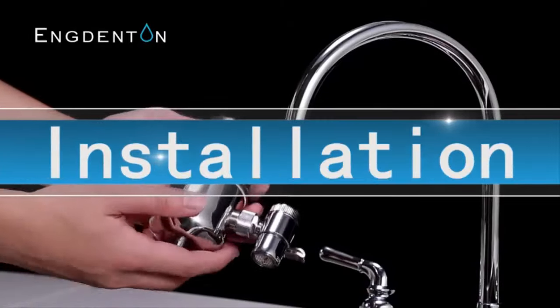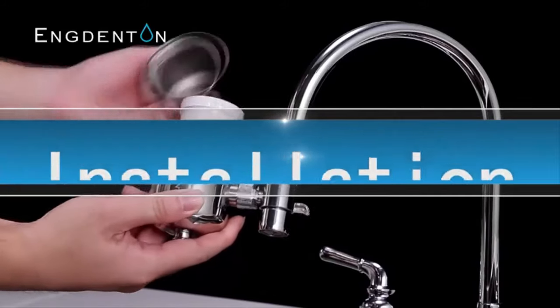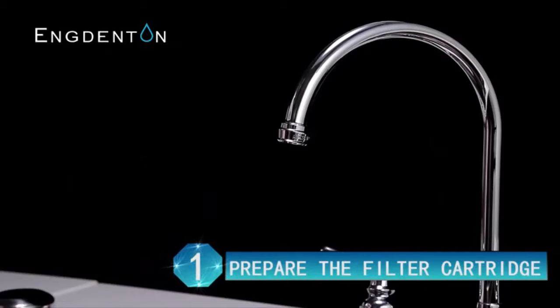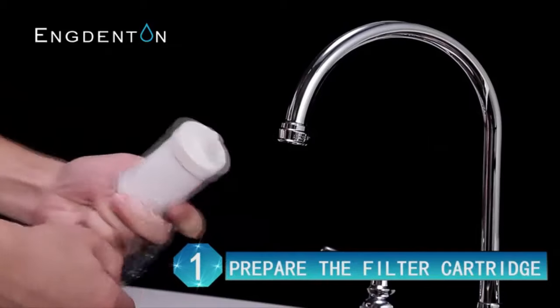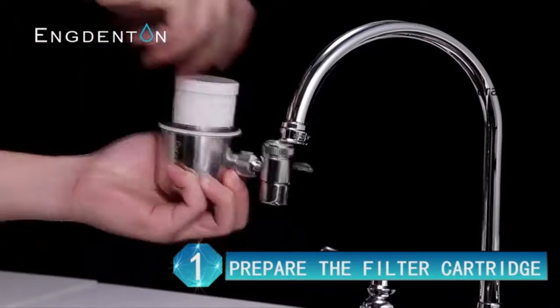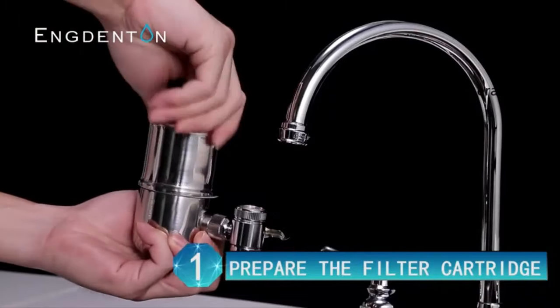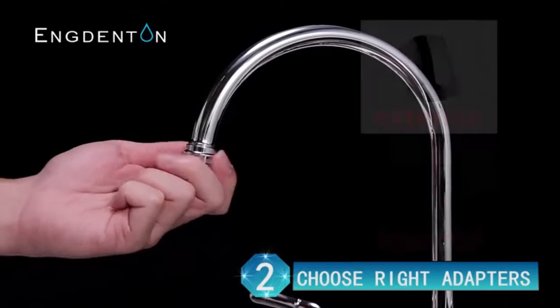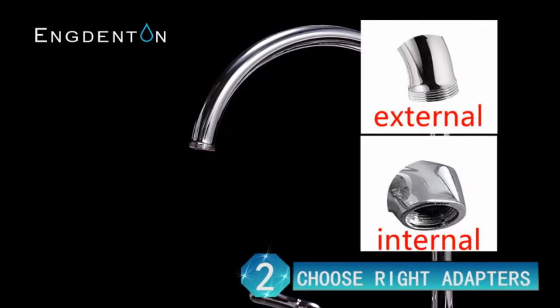Now we begin to install the faucet purifier. Unscrew the top cover. Take out the filter cartridge. Remove the wrap. Insert the cartridge to the base tightly. Screw the top cover. Remove the aerator from the faucet. Identify what kind of thread it is, external or internal.